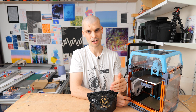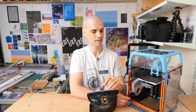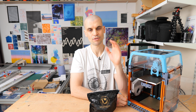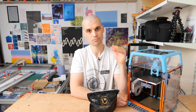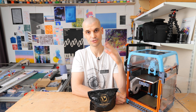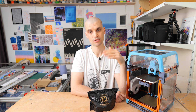This is a really cheap and relatively simple upgrade. The carbon pellets are low cost - this bag should last about 50 hours of printing in a small chamber. I think it's a no-brainer upgrade for any Voron owner. More and more 3D printers are coming to market with air filters, but don't be fooled by printers advertising a HEPA filter - VOCs are much smaller than particulate matter, so a HEPA filter won't do anything for the most dangerous stuff, especially when printing ABS.